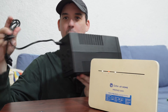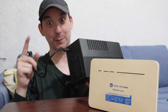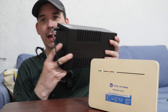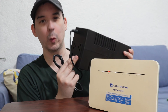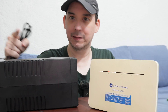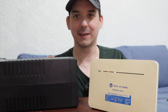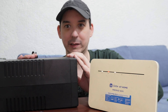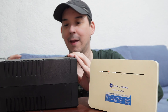This is the UPS you're more commonly familiar with — it plugs into the wall. When the power goes out, you'll recognize that beeping sound. These are very good and simple for people to use, but they really waste power and money because you're going from AC to DC, back to AC, then back to DC again. There are so many losses along the way.